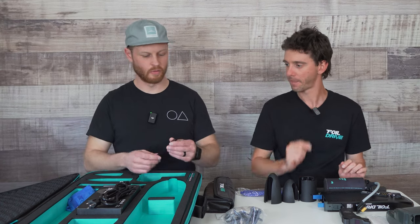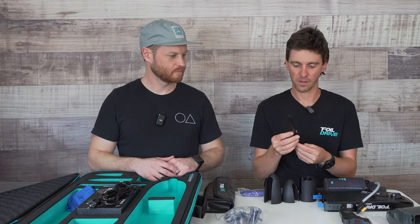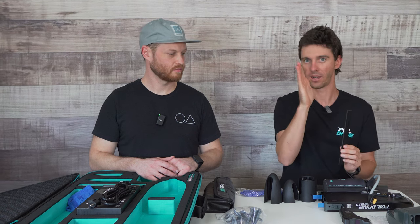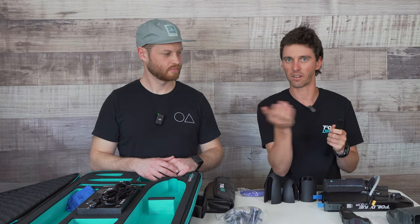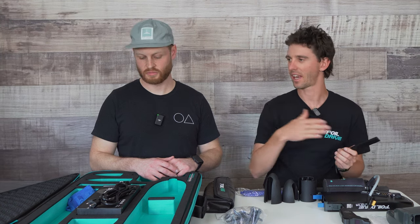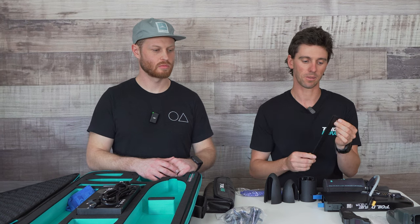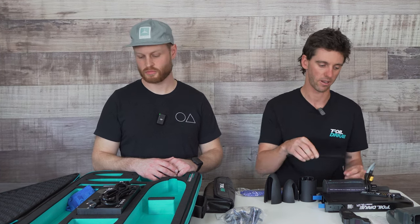Then we've got this unique-looking piece here — it's a rubber cable guide. With the slotted section you can slide this over the trailing edge of your mast, and then the cable tracks up the back of the mast; this just holds the cable centerline up the mast. You can use a few wraps of electrical tape or duct tape — something with a little bit of stretch — and that really helps water flow pass around your mast and around the cable smoothly. You don't want that cable flopping around in the back; it causes a lot of drag. You can cut them to length and get extras if you need longer pieces.